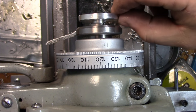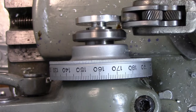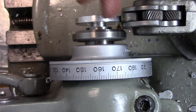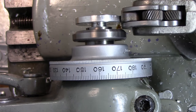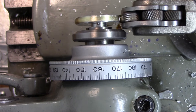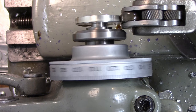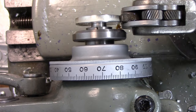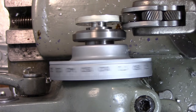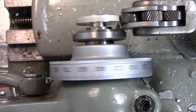Set up my knurling tool real quick. We'll give that a quick knurl. Now, there are all kinds of math equations you can do to make sure it doesn't double knurl itself, but we're just going to go for it because that means that we would have to turn down to a certain diameter and all this other stuff. So we're just going to see how this looks. Not too bad,